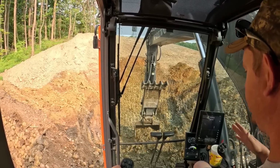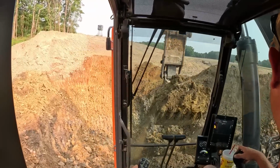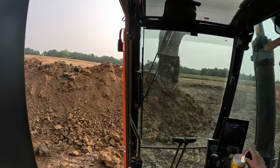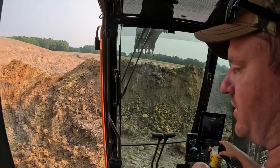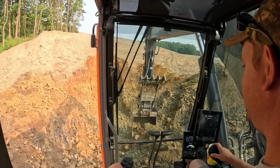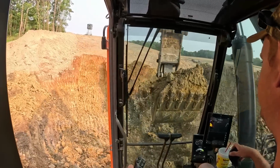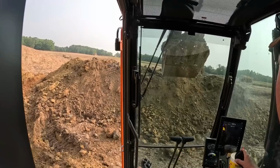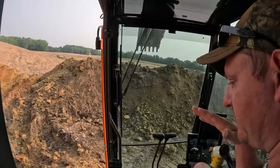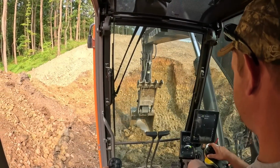As we put the clay in here, I'll take the dozer and just keep pushing that up against this front edge and getting all that tracked in and compacted in, and that will save on a lot of the clay rolling out and wasting it. So we have a lot of clay, but it's going to take a lot of clay for this pond dam, and I don't want to waste it on a slope where it doesn't really matter what type of dirt is used. I just need it for the central core of the dam, you know, a good 20 foot wide.